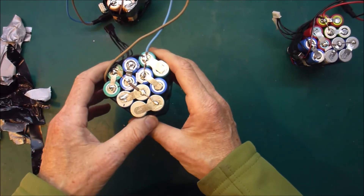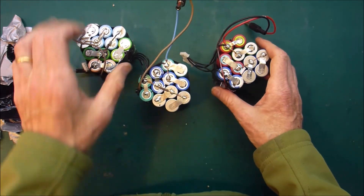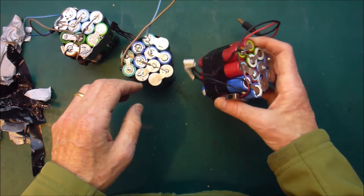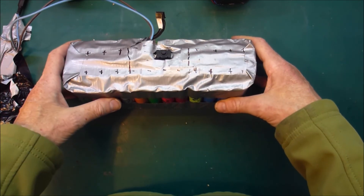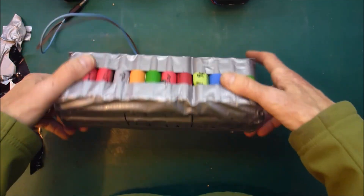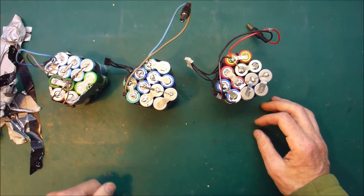What I think I will do is pull these apart and re-capacity test all the cells to make sure none of them are now dead. The other thing they had was this monster pack, and currently one of the groups is at zero volts, so there's something bad happening in that one as well. I have much to do. I'll do another video once I get a bit further on with these. Thanks for watching. Cheers.